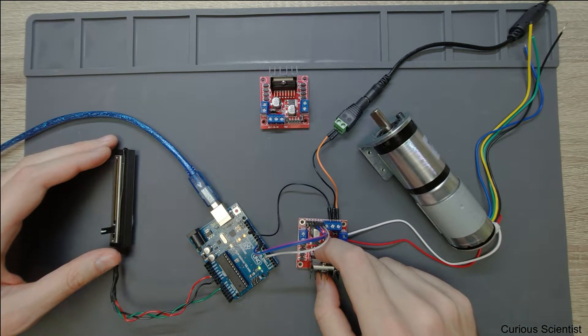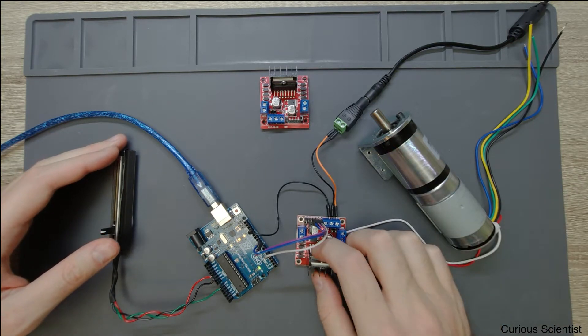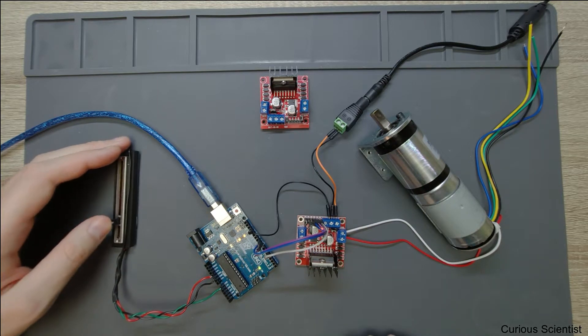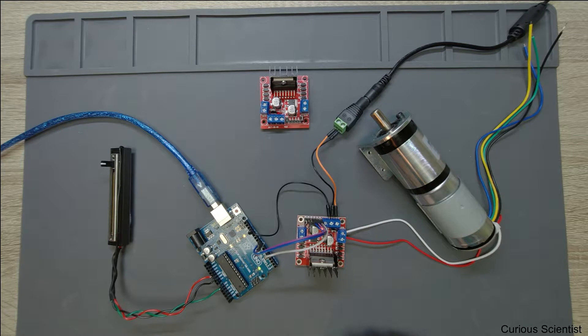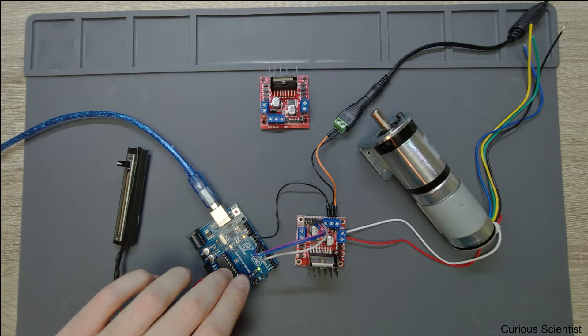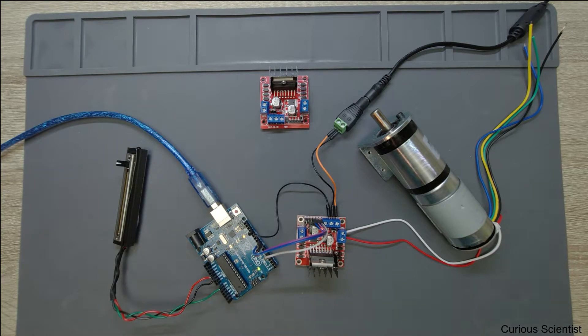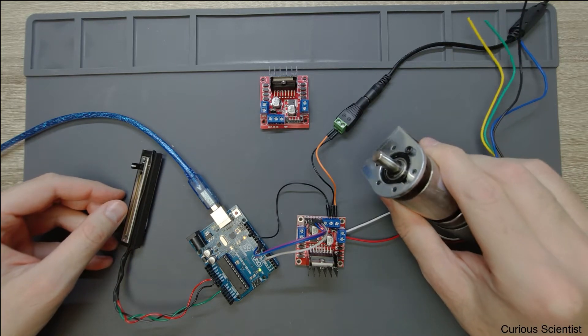The chip is not hot at all — I can keep my finger on it — so that means there is very little power flowing through this chip. Now I go to zero and just stop the code. That was a simple introduction; now I'll show you the code on the Arduino and explain how to convert the value of the linear potentiometer to a PWM value which goes to this circuit. Once you have that, you can also convert the value to RPM on the motor.